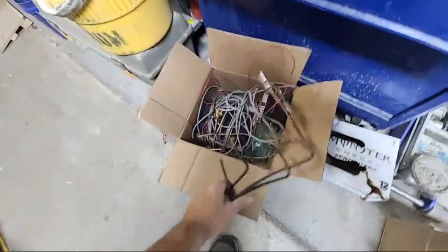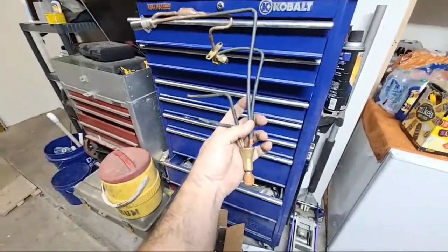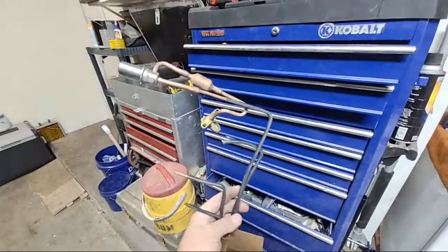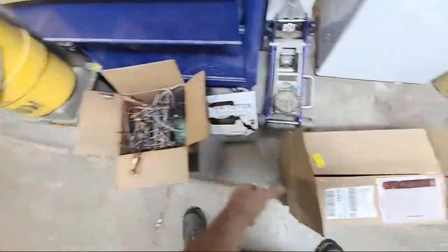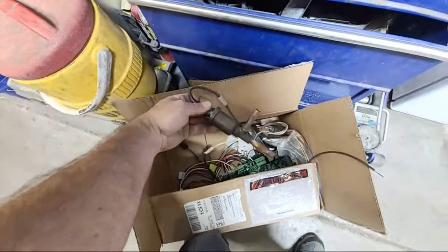Over here is what's left of the manifold — I'm cutting three of them off just for messing around. But look, there's no capillary tube in between there, it's just quarter-inch tubing. Here's the port that went to the outside of the unit going to the inside, so it had to have been controlling it with that expansion valve both ways.